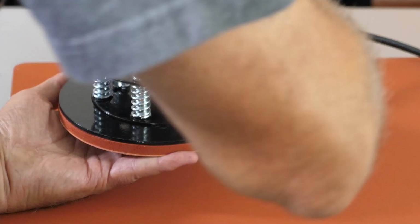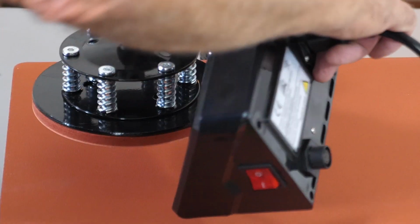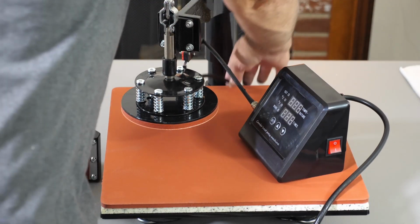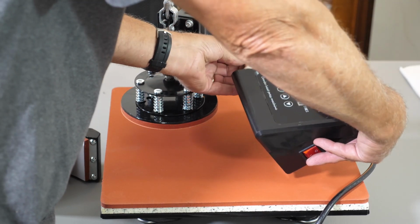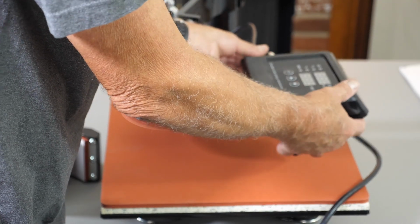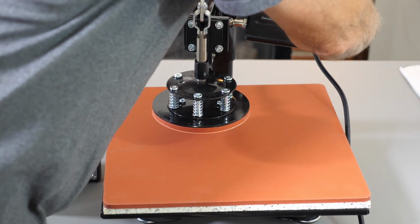You tighten down these two screws, and to connect that, you'll have your limit switch again, as we had when we're using the platen press for the t-shirts or whatever, and you put those into the 2-hole DIN connector. Plate press, you see, has a 4-pin female. That also goes into the side here. Oop, don't turn that on yet. You should probably have this unplugged when you're doing this, really. And this will just mount right back on the column. And you can see what you're doing.